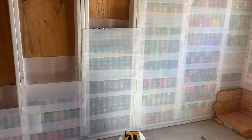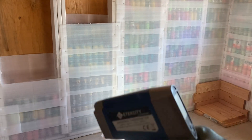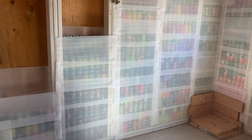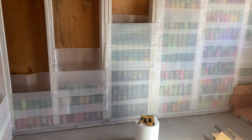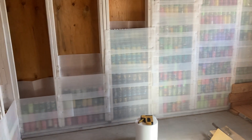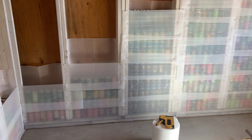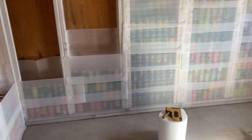This foam is rated at R1 and R value is additive — double it, triple it, quadruple it: R2, R3, R4. I'll say this is something like continuous R1.5 insulation across the interior of the assembly. Most homes don't have any, so that's a huge step up. The foam is also holding the cans in place — they stack well on their own and are light as a feather, but the foam prevents them from just falling out of the cavity. The foam is also giving us an acoustic benefit, reducing sound vibrations and sound transmission, which is very important unless you like hearing all your neighbors.